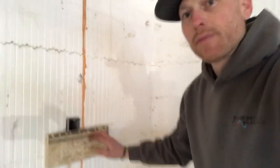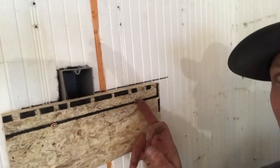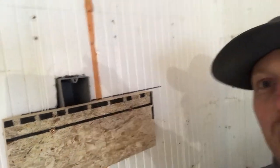That's how we get our wires from point A to point B. Where it comes to the outlet box or a switch box, here we are in the kitchen, so there's going to be a fair amount of work with the trenching. What you can see we've done here is we've got that box sandwiched in there, screwed at every eight inches, holding that box up against the concrete on the back side.